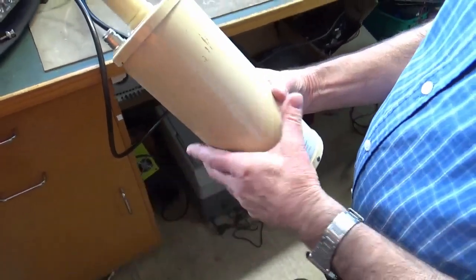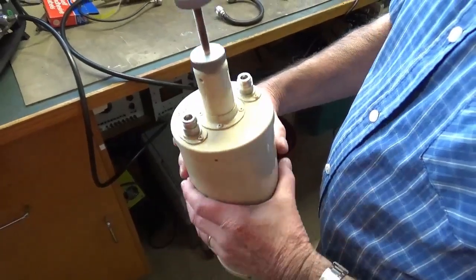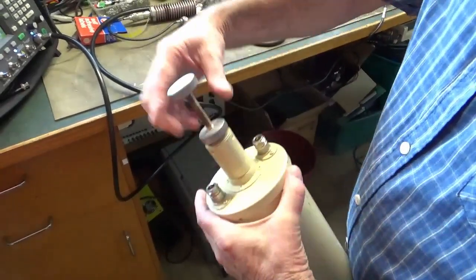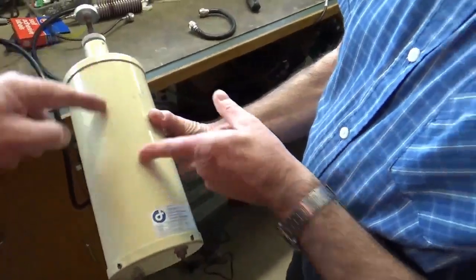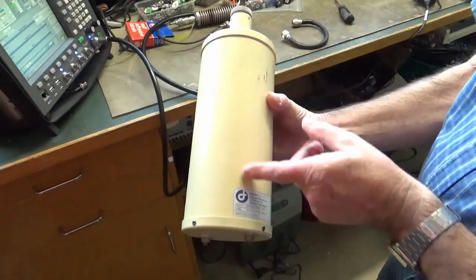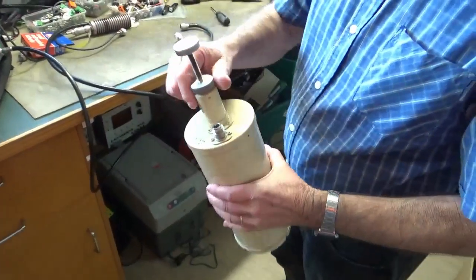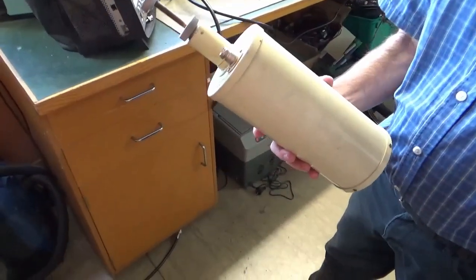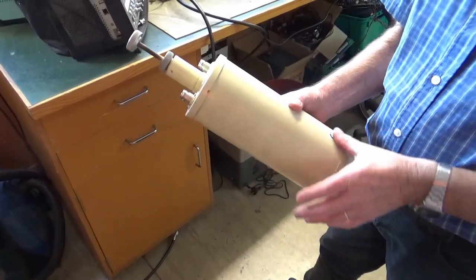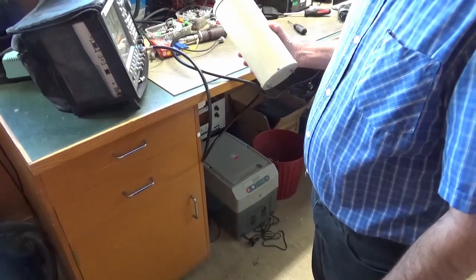I've had two plates of these where there were cavities on the plates and I have modified them. These originally were bandpass, which means they only pass a specific frequency that the tuning is aligned to. This tuning shaft goes in and out and actually lengthens or shortens the inner tube inside at a certain resonant frequency. Once you've got where you want, you can lock it up. We've used six for the repeater — two bandpass like this one — one in the transmitter and one in the receiver — to keep our signal out of any adjacent radio equipment on site, and to keep other site equipment out of ours. That's the advantage of bandpass.